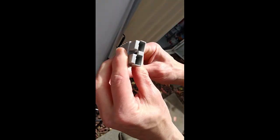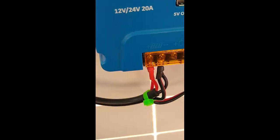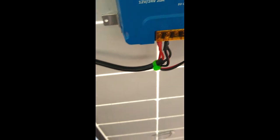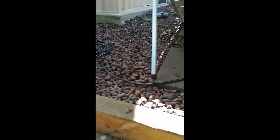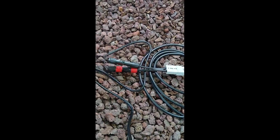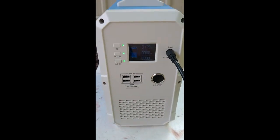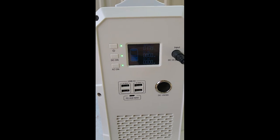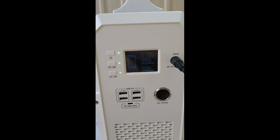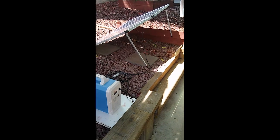Overall summary of the final setup: the power lead comes out of the panel, cable-tied because I love cable-tying things, into the Anderson-to-MC4 adapter we bought, and then into the Bluetti — which is now giving us a very nice 177 watts of free energy. And that's your basic setup done.